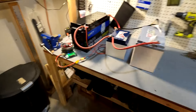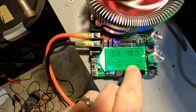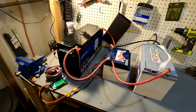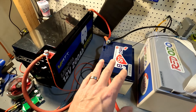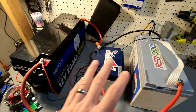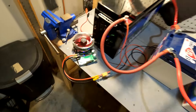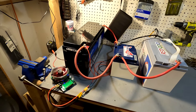I just want to give a quick update on our progress on this battery discharge. We are looking at 171 amp hours of discharge so far out of our 350 amp hour bank. That kind of passes the idea that we would only get 150 amp hours if we multiplied the lowest battery by the number of batteries — so that's going out the window. Our voltage right now is still 12.3 to 12.4, and I'll see you again in probably another 8 to 10 hours.